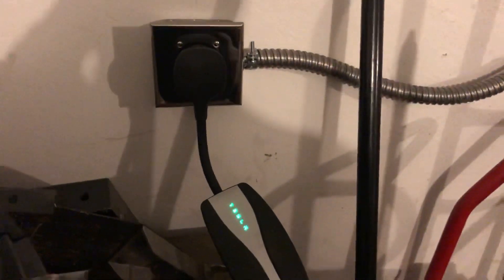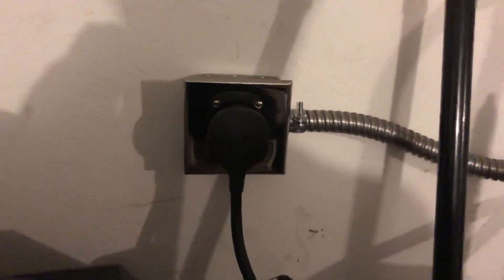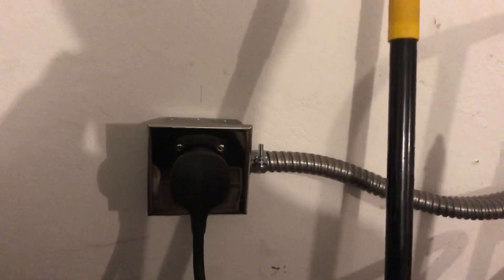I'm going to show you charging a Tesla at home. I wired up this NEMA 14-50 outlet to a 50-amp breaker in my panel — right there. The NEMA 14-50 is basically what a lot of ranges use nowadays. It's a 240-volt outlet that also includes a neutral. The Tesla Model 3 comes with a plug adapter to plug right into that, which connects to the Tesla cord I have strung out over here by the car.